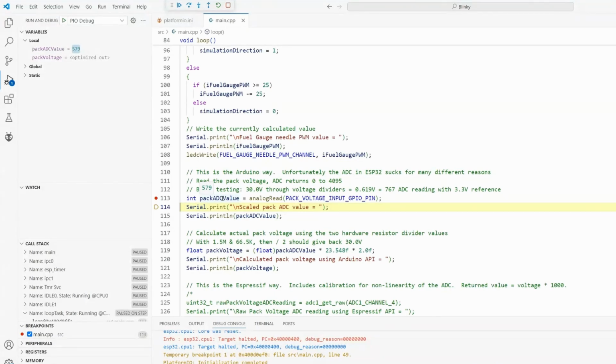from the start? One thing I thought about doing was actually putting one of the cute, tiny little ADS1115 analog to digital converter chips on the board. The thing's the size of a couple of grains of rice, but it's got 4 channels of insanely highly accurate analog to digital capabilities. But I forgot to do it as part of this design. I forgot, and I put my trust in the ESP32 chip, but this is clearly not working for us.